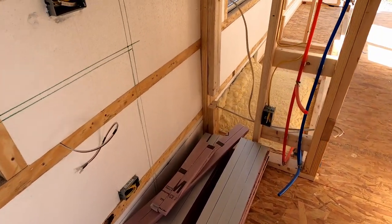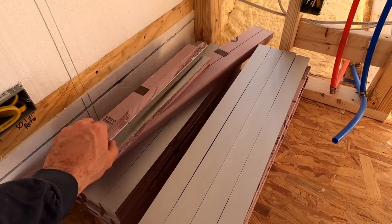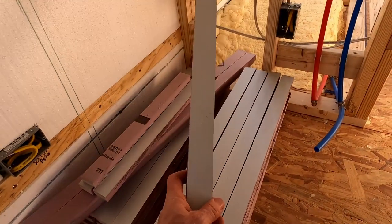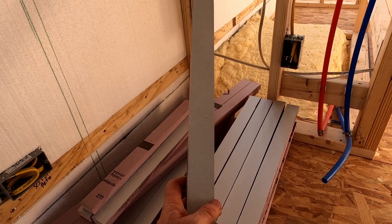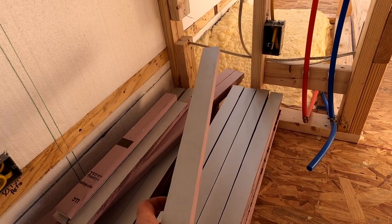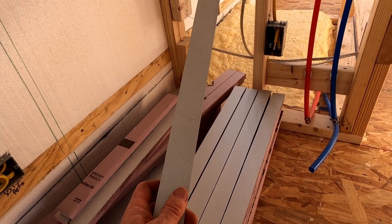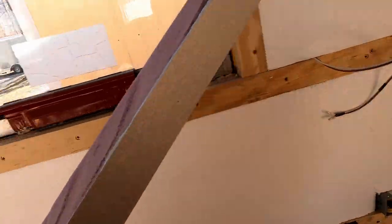But I do have my foam down here. I don't know if I explained what I was going to do with that, but I ended up getting pink foam and then cutting it into 1 5/8 wide strips this way. And then I painted it with just aluminum enamel. You can't really spray paint the foam too much. It causes a weird reaction with the foam. So I just rolled it on there using some regular canned enamel. And just did the one face of it, because what I'm going to do is use these.